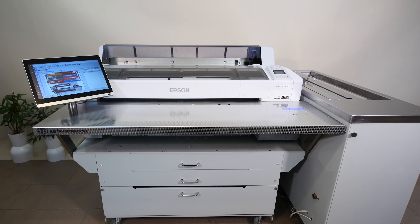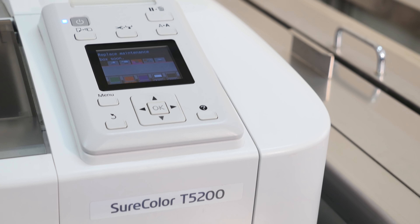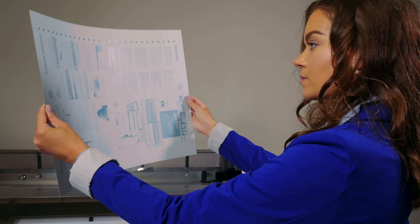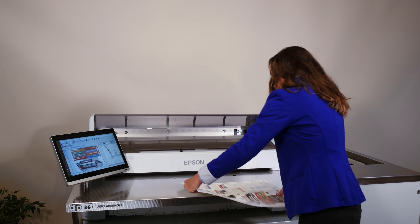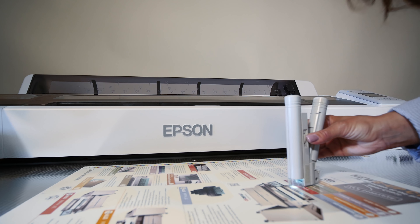The DTP-36 is an inkjet CTP system producing truly conventional offset plates. While most inkjet CTP systems are targeting the low-end market, the DTP-36 is a true alternative to laser CTP systems with its impressive quality. The 175 LPI halftone printed at 2880 by 2880 DPI is smooth and the screen dots are sharp and round. Using the patented edge enhancement and ink spread compensation technologies, texts and vector objects are sharp even under the microscope. Jobs printed using our plates are very difficult to distinguish from those printed using laser plates.